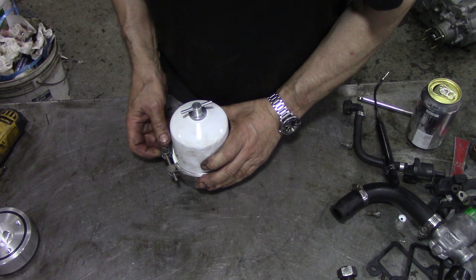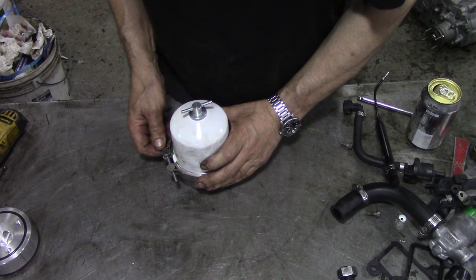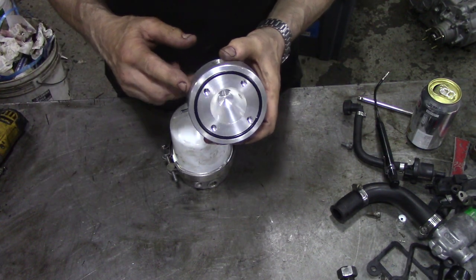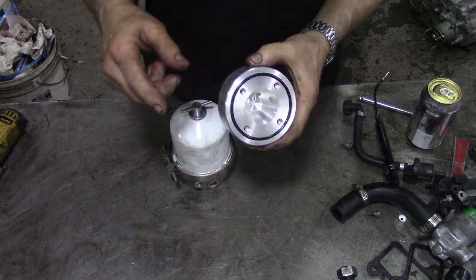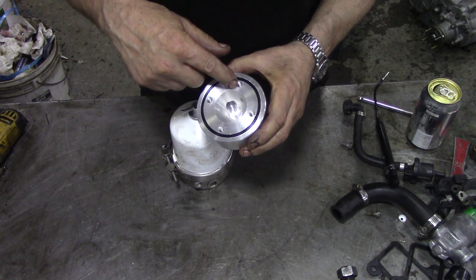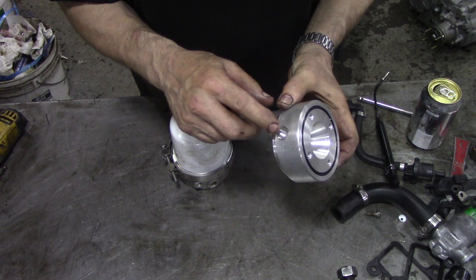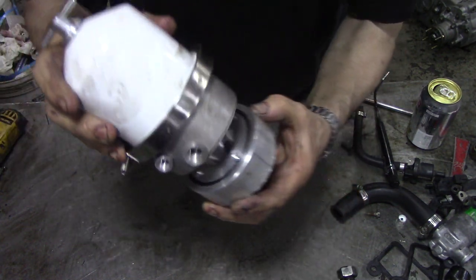But you don't get a base — that's a problem. Digging around on the internet, we found an image of what a base should look like. I was wandering around JP's shop and found a scrap piece of aluminium. So we turned it: put a groove in for an o-ring, tapped out four holes, made a little funnel so the clean oil will come out, and that then bolts onto the bottom of the canister.